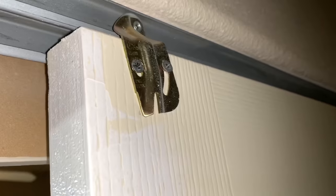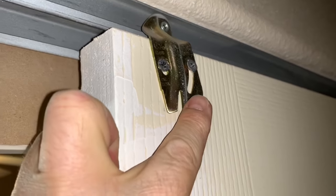This is adjusted in the back. Each side has rollers — one over there and one here — and there are two screws. This has a sweep so you can adjust it and have this side of the door go up or down. The question is: do we want the left-hand side of the door to go up or down, or the right side? You can tell by moving the second door and finding the level on them. Those are about perfect, so I would adjust this right side up, which is going to close the gap. The easiest way is to take the door off so you can get to the mounting hardware on the back.